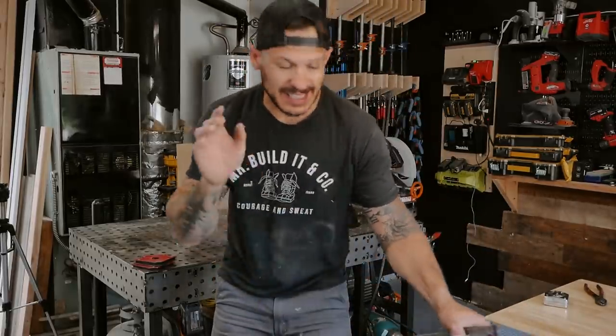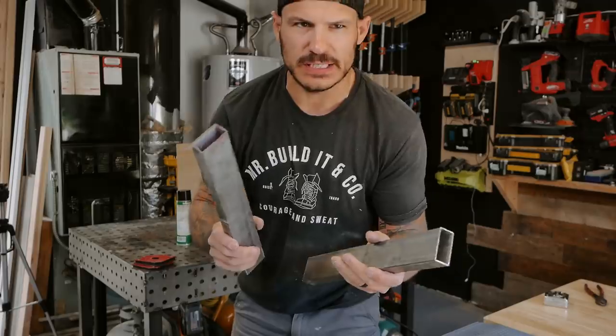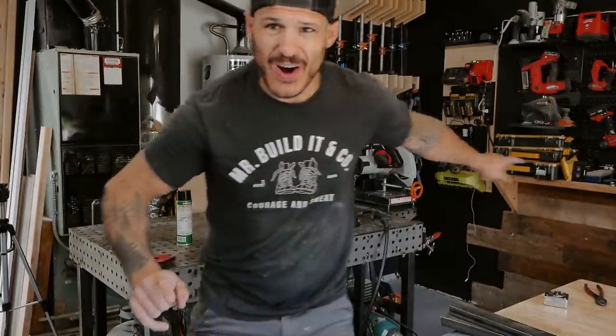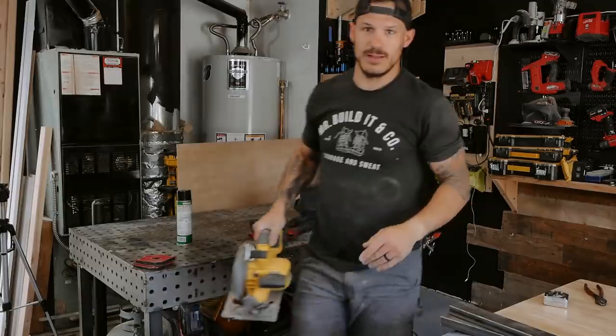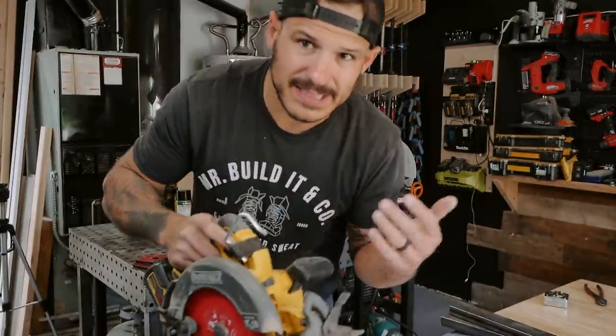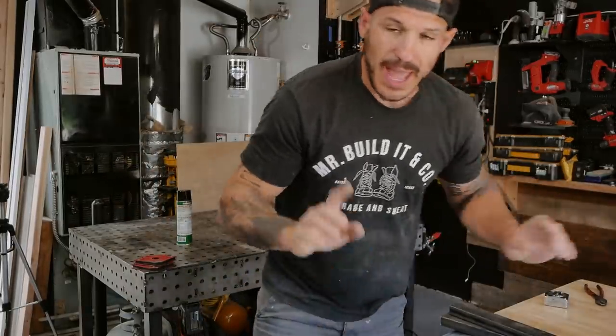Now for the legs — the last and final part. This was leftover steel from my staircase project; go check that out if you haven't seen it. I got it from my local steel shop — probably about 30 bucks worth of steel. I cut it on a metal-cutting chop saw. If you don't have one, use a reciprocating saw, and there are specialty metal blades you can put on them. A lot of people are intimidated about welding, and you really have no reason to be. In the back of almost every welder there's a chart based on the steel thickness — mine calls for a setting of 3 and a wire feed of 35.